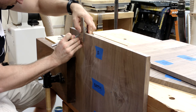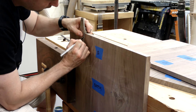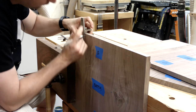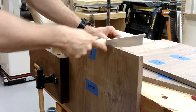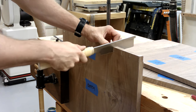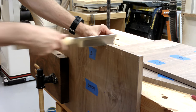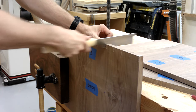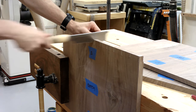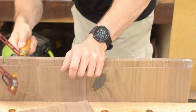I'm using a 1-to-8 ratio to mark these out, and I'm doing my marking with a knife. My marking knife isn't anything fancy - it's basically an X-Acto blade. I'm taking light cuts rather than going too hard; a light cut will allow me to score it, and then several passes will get me the depth I want. My preferred method for cutting dovetails is to use a small Japanese dovetail saw. I like the control it gives me. There's nothing right or wrong about using one type of saw or another - I just happen to like cutting on the pull stroke. When I cut, I make sure to cut on the inside of my marked line so I can go back and clean up to my mark with a chisel.